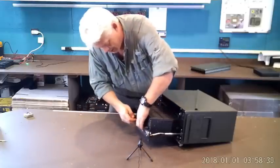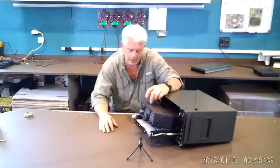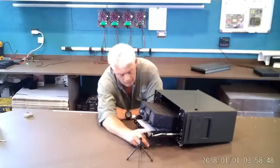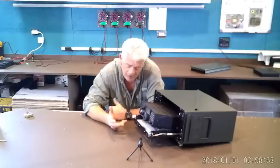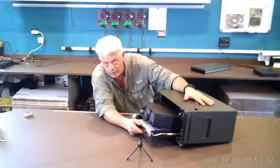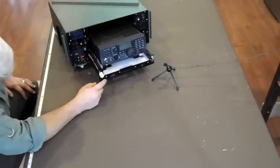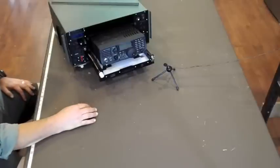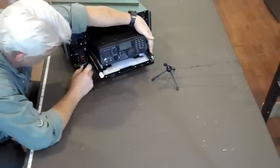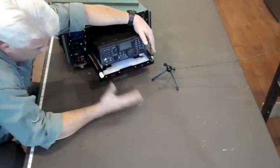Kind of neat as well — if you want to, there's actually enough room to use the bail on the rig and tilt it up even more. The antenna extension and ground extension are both part of this slide, which was a neat way to eliminate the challenges that would be involved with cable management if we had to have that much loose cable in the rear to allow the slide. Once we figured this out, it makes it very clean, very easy, very reliable. You can also plug other connections — data, USB, or whatever — into the back of the rig, run up either of the two raceways, secure them with the bungees, and run those cables through the openings for nice cable management right out front where you'd want them.